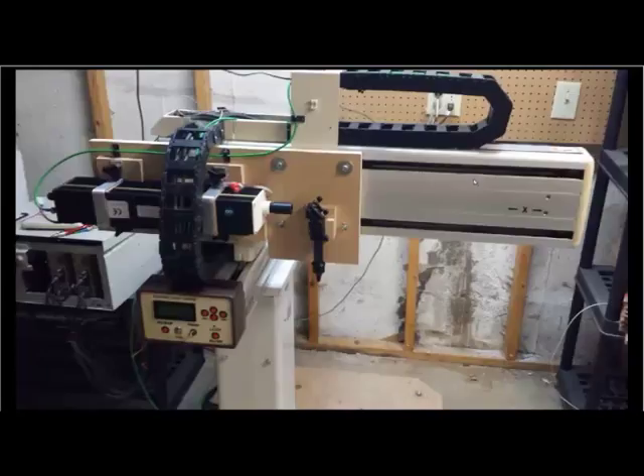Here's a photo of it again on the robotic arm itself. You can see I've added a little bounce mirror to take the beam down and I've put a beam expander on the end of the laser. I 3D printed a little cover with a port for the beam expander. This is because I'm using a very short distance from the laser to the material. Normally you want about 6 feet from the end of the laser to the cutting surface so that the beam divergence gives a large spot of radiation on the lens. The larger the spot on the lens, the tinier the focal point will be. This laser control box could also just as easily control a laser diode or any type of laser with a little modification to the code.